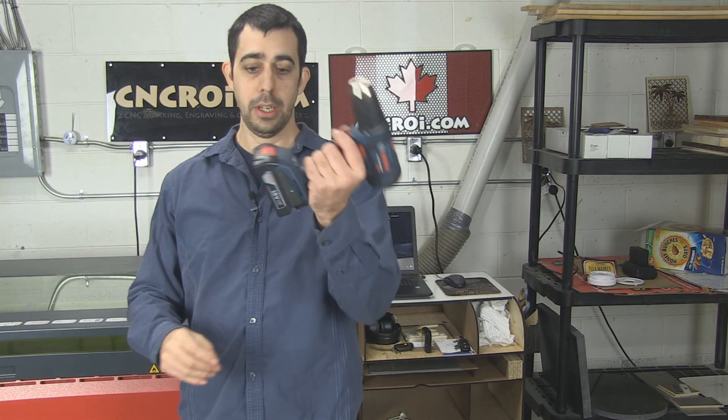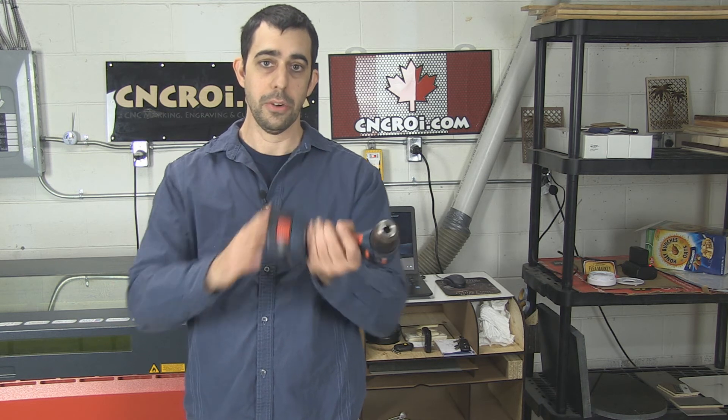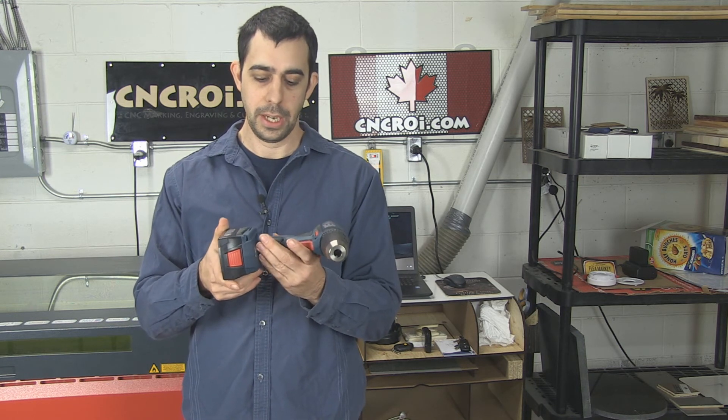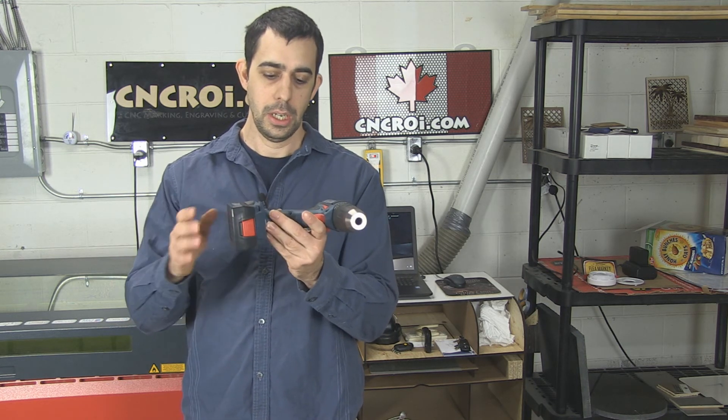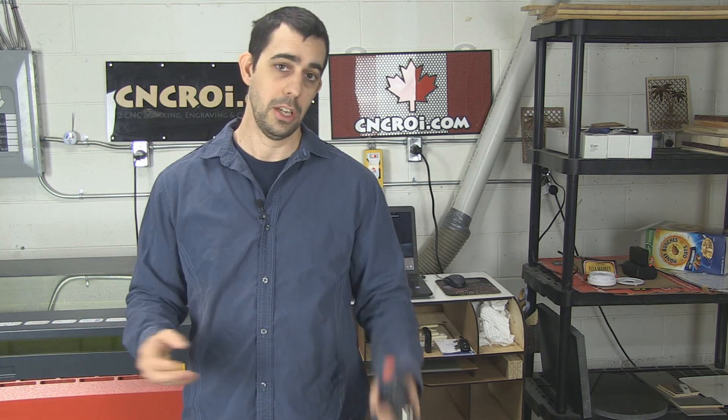And now you know how we engrave this. You'll notice we also engraved or color changed the plastic on the battery itself — still works totally fine. The reason is your laser is never touching the tool; it's only a beam of light that's heating up the surface and color changing it or engraving into it. So even if you have tools that are very expensive and very fragile, the laser is the perfect tool to do all the engraving and branding you need to prevent theft and to make reorders a lot easier. So if you're looking for a company that could do that for you, we're right here — we can do it for you. I'll see you in the next video.